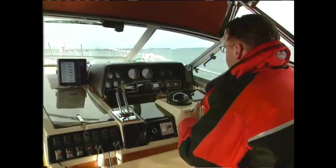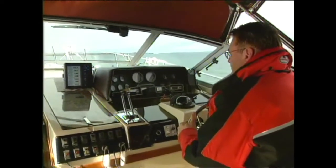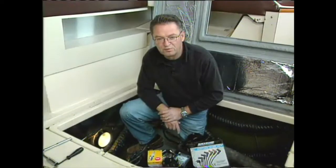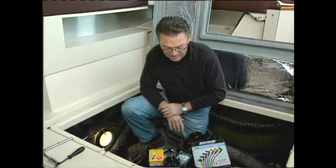To get our readings, we headed out to calibrate the unit and record the baseline fuel consumption prior to working on improving fuel efficiency. At the boat's cruise setting of 3600 RPM, we recorded fuel flows of 19.36 and 19.83 gallons per hour for the MerCruiser 454s. We've had the boat out for a run and set our base fuel consumption numbers tracked on the Navman.